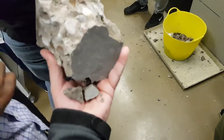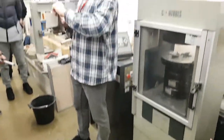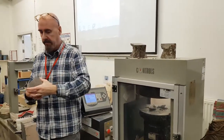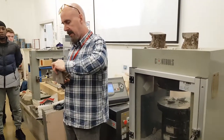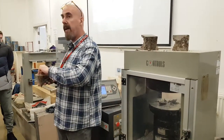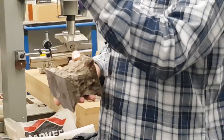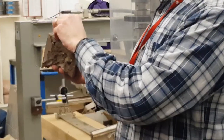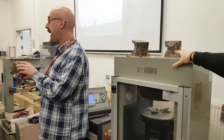And when I said that generally natural aggregate is about 10% weaker than crushed rock aggregate, this is partly the reason. You see like a smooth socket where it's come out — see, that's like a smooth socket. Now, with a crushed aggregate, that surface is all irregular and it grips that sand cement matrix a lot better. So we end up with, everything being equal, a 10% increase in strength. And that's the reason.